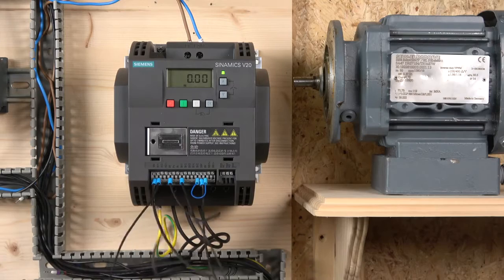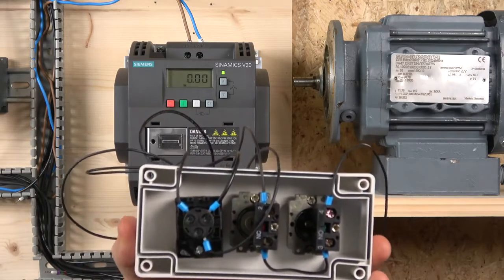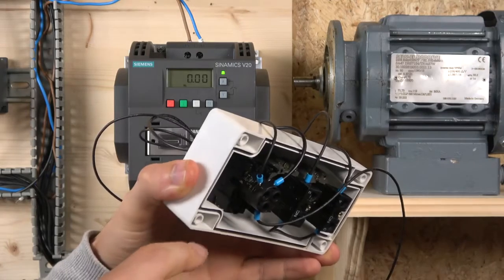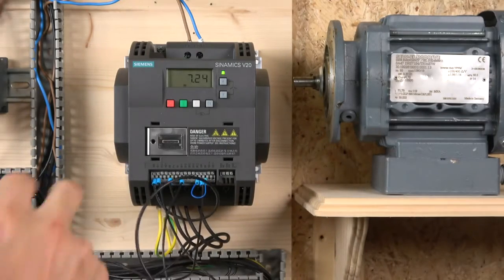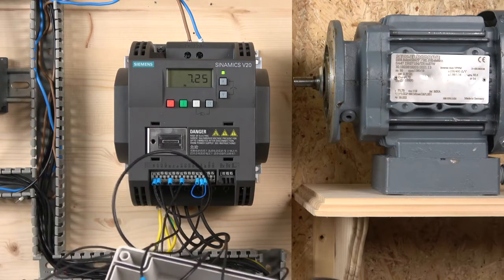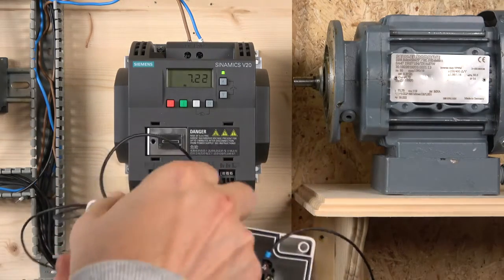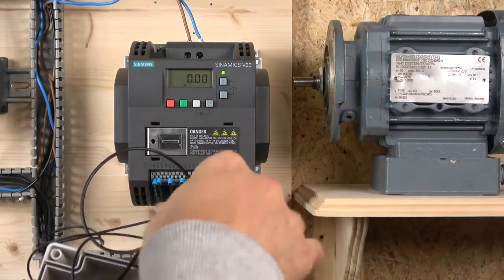I have 24 volts. With the Siemens potentiometer, because it's made by Siemens, it really matches the drive as well. So it's got numbers in here. I'm not sure you're able to see, it's like 1, 2, and 3 around, and they match up with 1, 2, and in our case, because we need a 0 and a 5, 1, 2 matches, and obviously the last one left went into the 5. So those three wires go back to 1, 2, and 5.